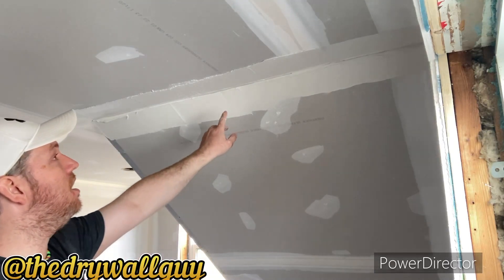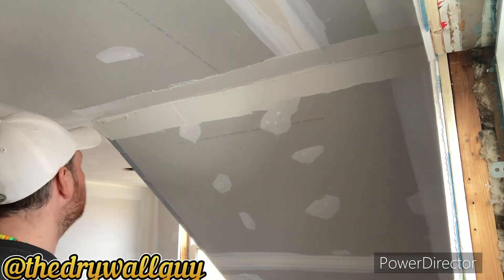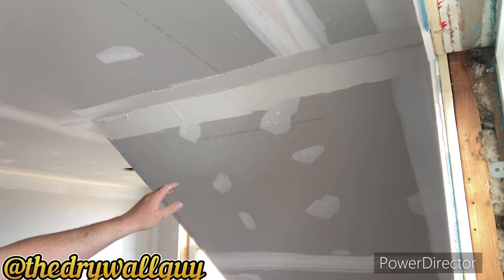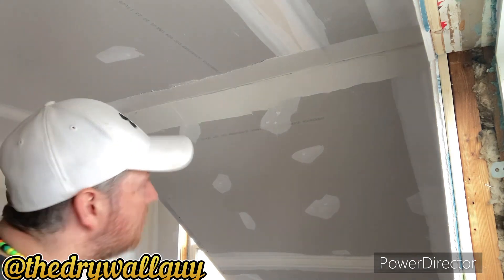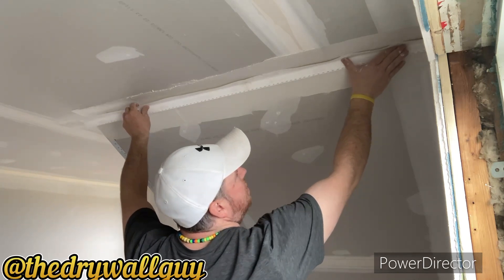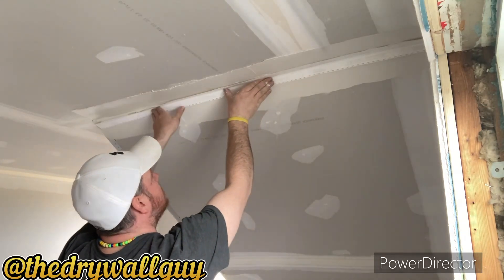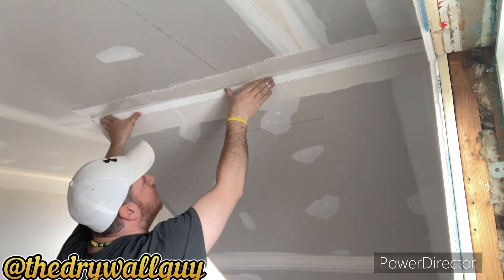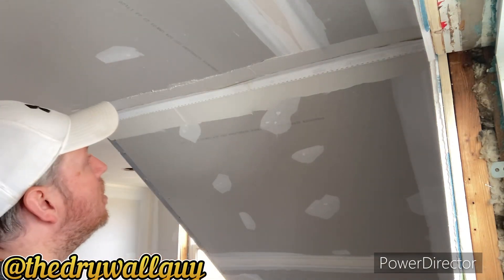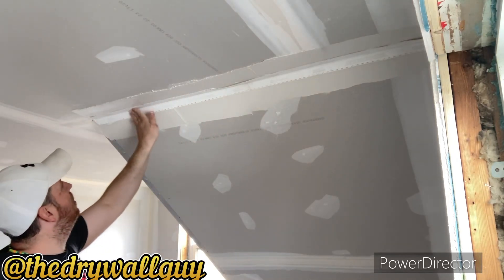This inside corner here is not very long, so it's pretty much straight just like it is. It looks good, it looks straight, but sometimes when they're very long you'll need to put a laser level on it. But not for this one. So what I do, I install it like this, and with my fingers I press the middle and you can feel where your drywall sheet, where the corner is. So you just press it and try to follow your corner, and then you can just place it with your fingers on the mud.